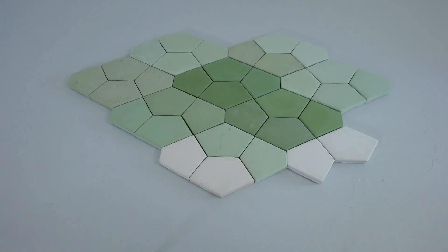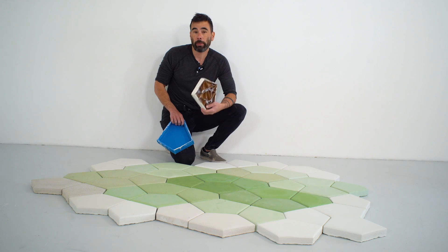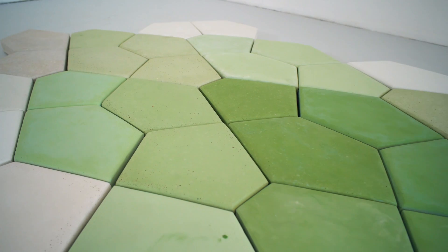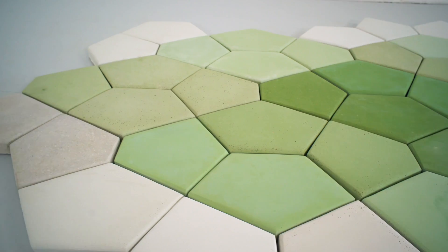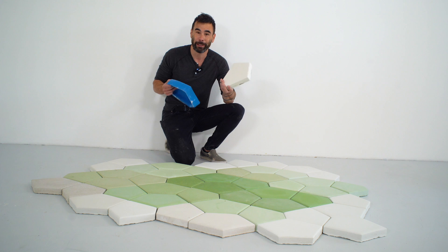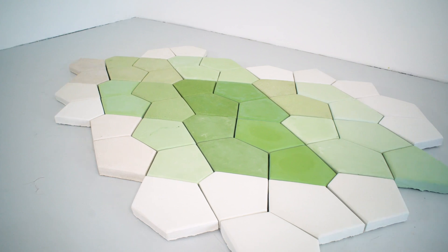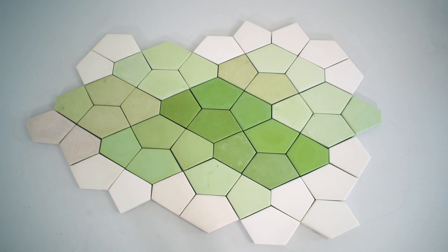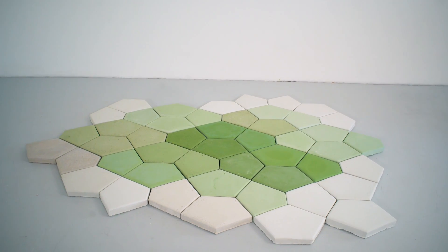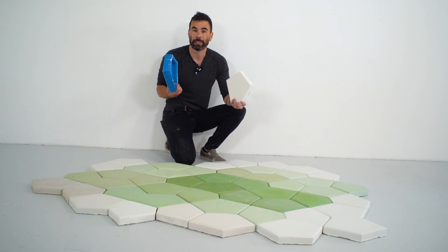The installation really isn't that hard — you lay down some sand and gravel, pack it down a little bit, make sure it's reasonably level, and then just place the pavers on top. What I like about this project is we take a common waste material like cardboard and use it as a prototyping tool to make a reusable silicone mold. You're only really limited by your understanding of geometry. Some people will say you can only do two pavers at a time, but these prototypes are still good — the silicone mold-making process didn't harm them at all, so you can make another set of molds. The cost-prohibitive factor is the cost of silicone, so it's just a matter of managing your time doing multiple pavers per pour versus the upfront cost of the silicone material. Thanks for watching — be sure to subscribe and post some patterns you'd like to see me do on Instagram, tag me, and I'll see if I can give them a shot.